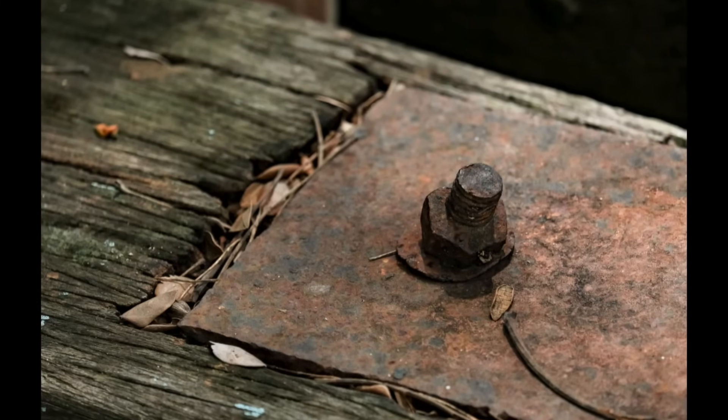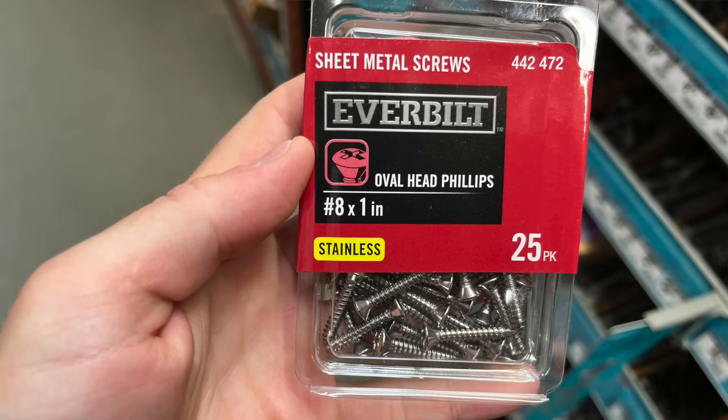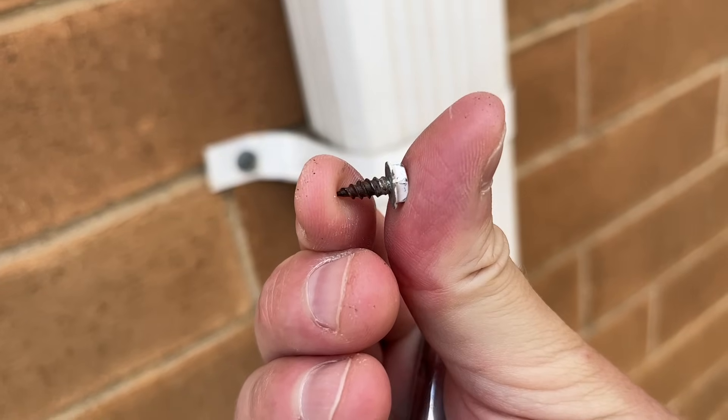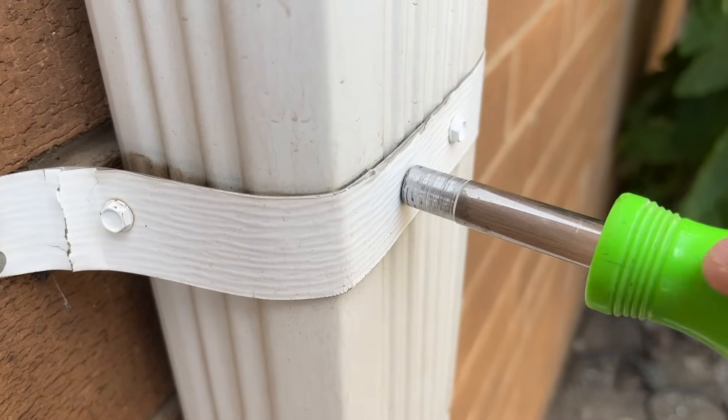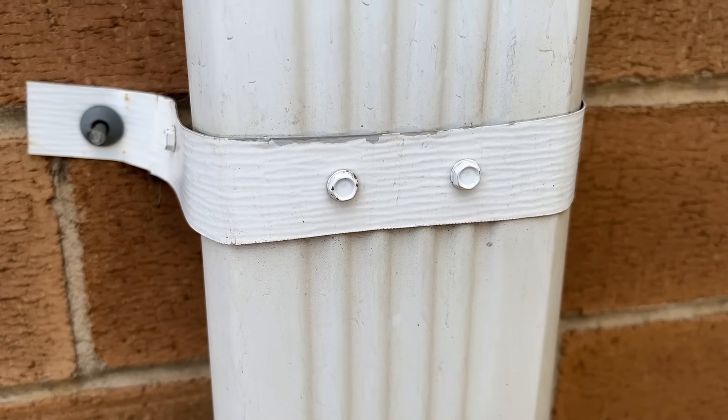If you wanted to attach metal objects together, or other objects to metal, you had to bore a hole in both materials and connect them with a nut and bolt — a laborious, multi-step process. Or for thinner gauge metals, you could also use something like a sheet metal screw, which pierces thin metal walls with a sharp point and otherwise fastens like a typical screw. You see them a lot on gutter downspouts, but they don't really work for any metal thicker than a sixteenth of an inch. There really wasn't a way to quickly connect thicker gauges of metal until these came along.